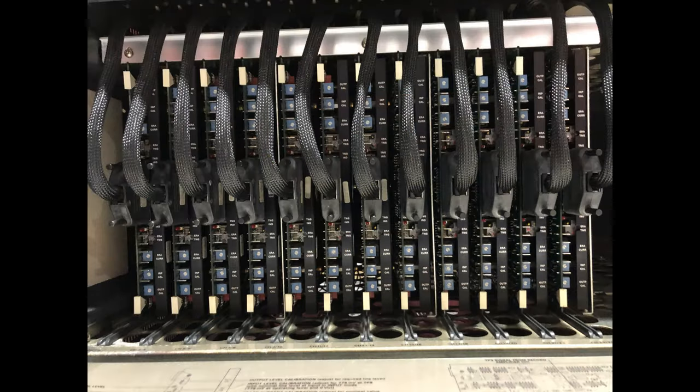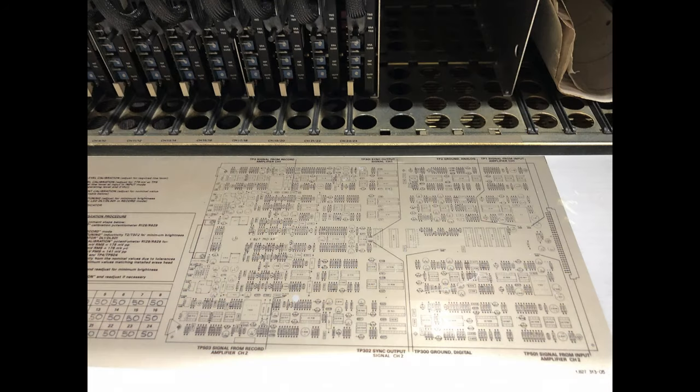Back to the 12 audio cards. These are located under the transport deck plate. External connections for audio, control and power are made both by connections on a back-mounted basis board and an umbilical connector, seen here on a lead at the front of the card. The cards are removed from the crate by removing the umbilical connector and then releasing the top and bottom catches. A legend on the rear of the fold down front flap shows a schematic of a card with the location of the hardware jumpers and adjustment controls.